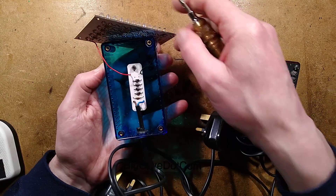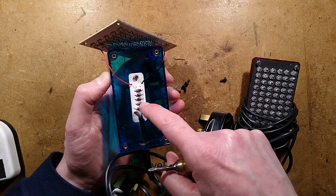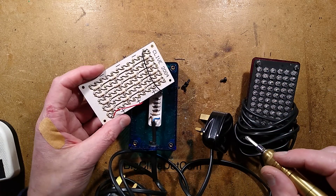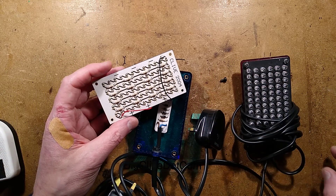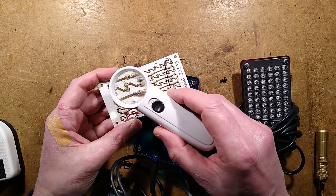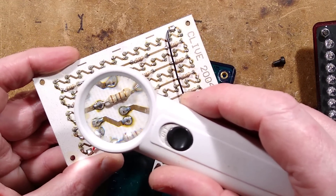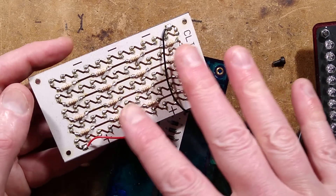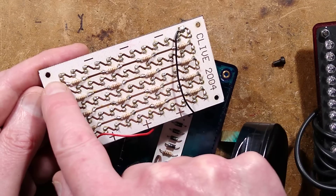I'm guessing I was putting in a fusible resistor - that's a 1k resistor - but there's a bridge rectifier and the mains comes in, goes through the resistor acting like a fuse. It's 2004 - that is 20 years ago. This is when the first affordable blue LEDs were coming available on eBay. These resistors are brown-grey-brown: 180 ohm. There are 16 of those resistors spreading the dissipation across the whole panel, kept away from the LEDs. The LEDs zigzag down and back, passing through all these resistors on the return run.